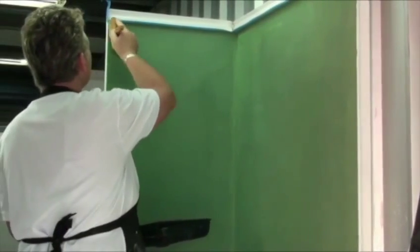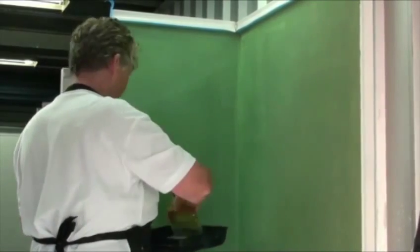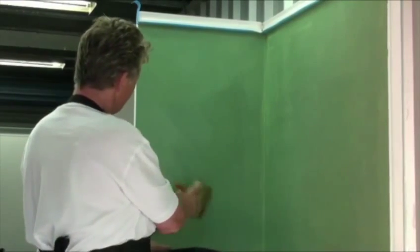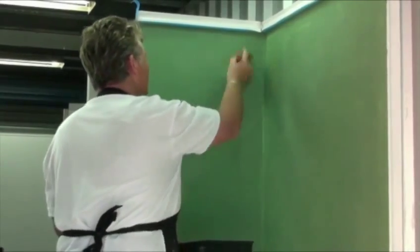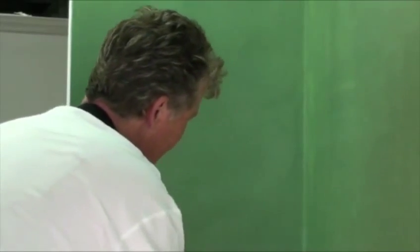With the Pure Bristle Badger Brush, fill 20% of the brush with paint and at approximately 200mm, apply it from the corner and push it up to the edge, then hook to the left. That's the movement for the edge. As you move into the flat, shorten the hook to a small crossing action, overlapping the cross action all the time.